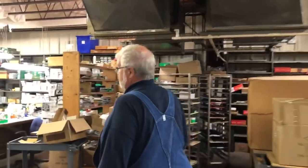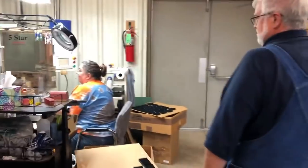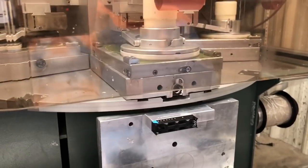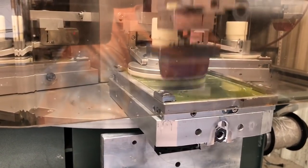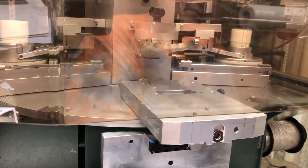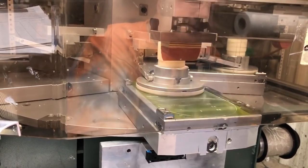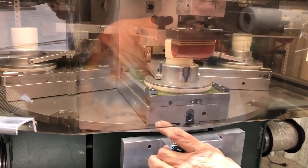This is our repair room, our pad printing. And this is Candy — she's been with us a little while. We're pad printing Z scale parts. The ink is in the cup, and as the cup moves back and forth it leaves the ink and an impression. Then the pad stamps it and transfers it to the car. You notice that the bottom table moves around and it's controlled by a computer to move into the right place.